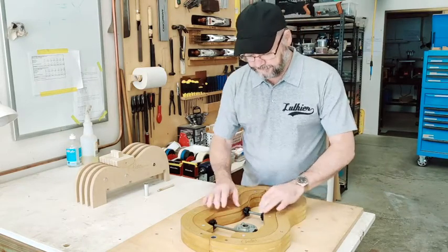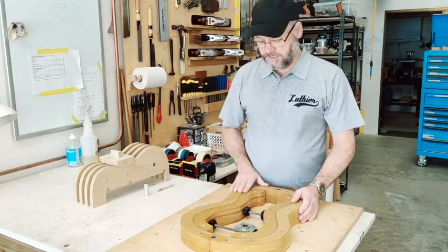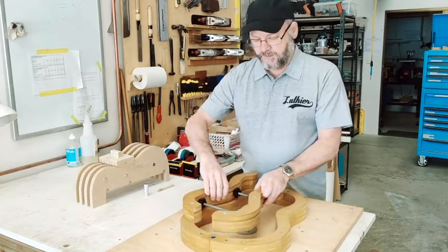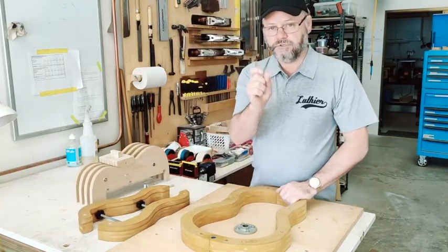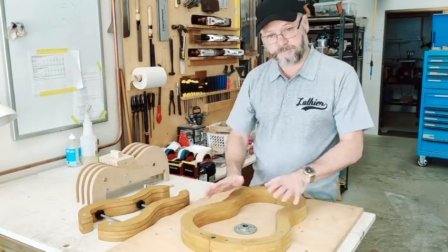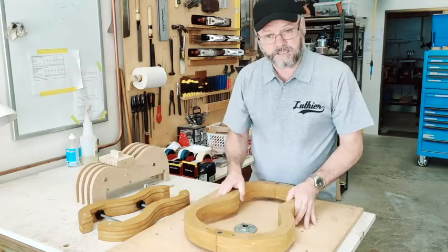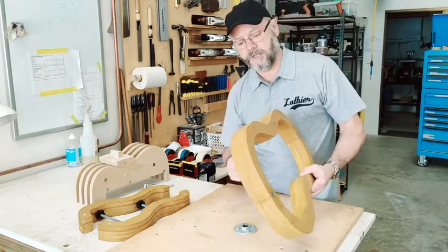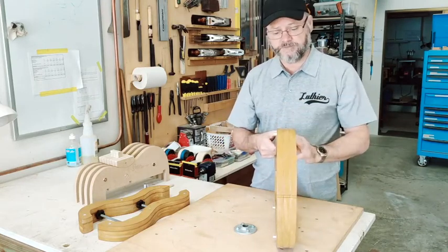So the first thing to say is that they are machined from MDF, precision machined using CNC technology. They come with a matching set of spreaders that are equally precision machined to account for typically 2mm thick sides. That's been taken into account on the shape, so with a 2mm side in they fit perfectly. The mould itself is made from, in this case, 3 layers of 18mm MDF. That gave us a total depth which was appropriate for the size of this guitar.